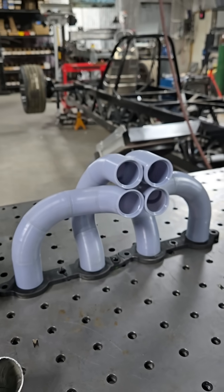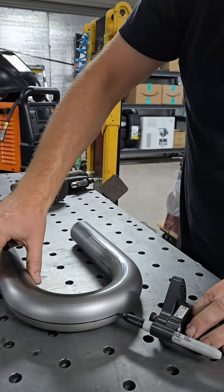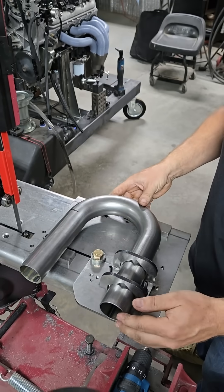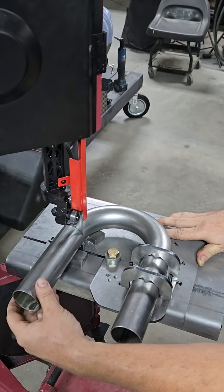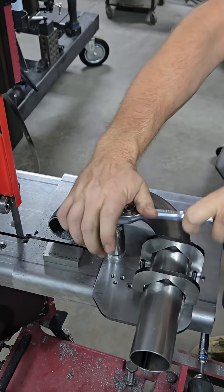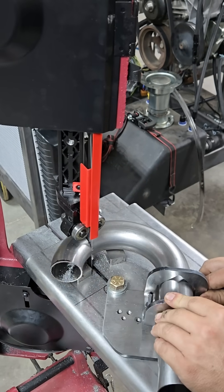That's what we're trying to make. Start by grabbing your U-bend and do a centerline mark — we need that mark there for reference when doing rotation. Load it into the jig and cut off the flat piece. Rotate to the first pie cut; the tick marks on the table help you get the angle right. Away you go — get it cleaned up and start welding them together.